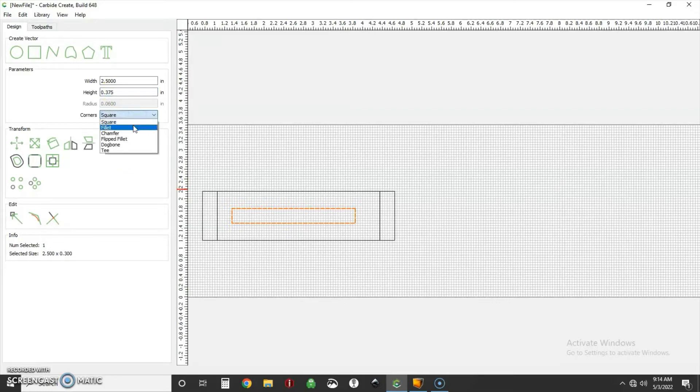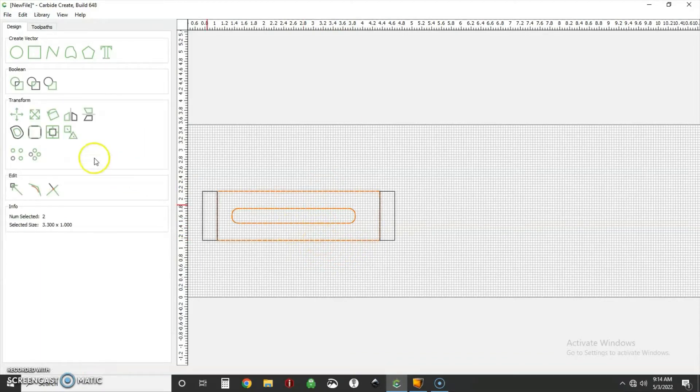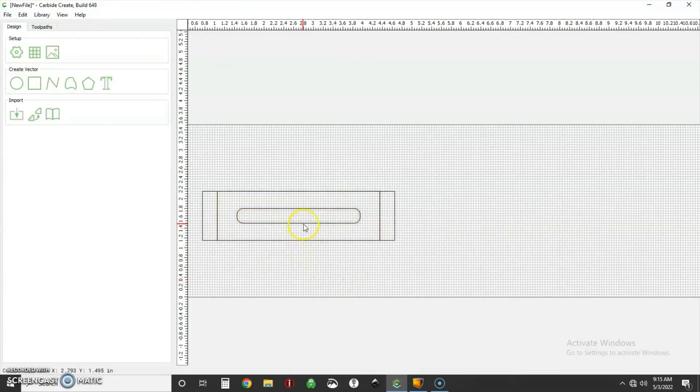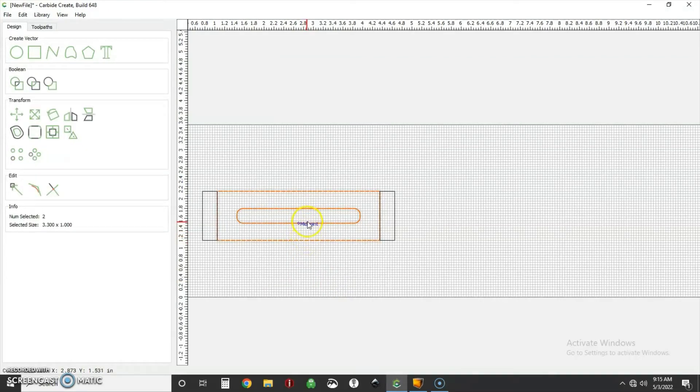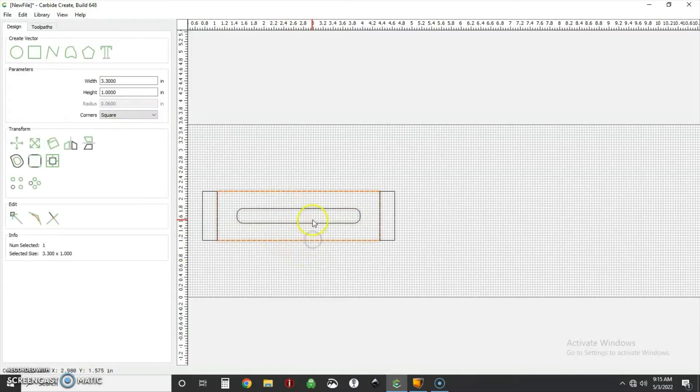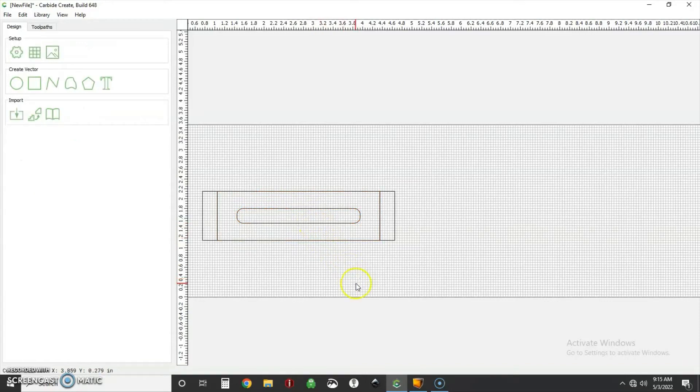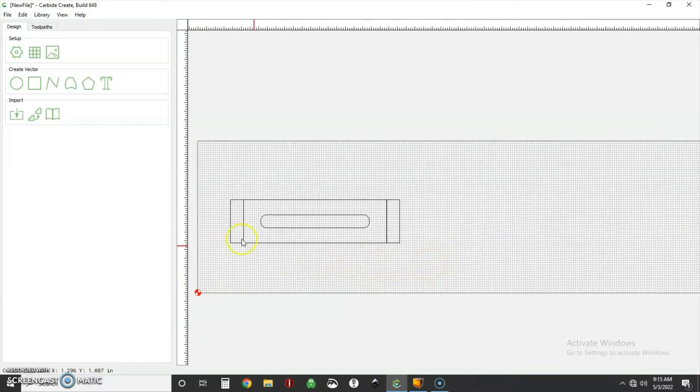Since I'm using a quarter-inch bit, I'm going to add a 125 thou radius to fill up the corners. Now I want to center the channel to the body. If you click the channel, hold Shift and click the outer box, you can go to the Align operation and align the channel relative to the last selection you picked. The order in which you click matters — it moves the first selection relative to the last one picked. So there's the basic design; we can grab the whole thing and move it around.